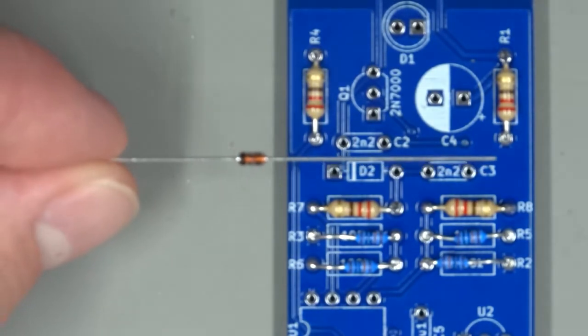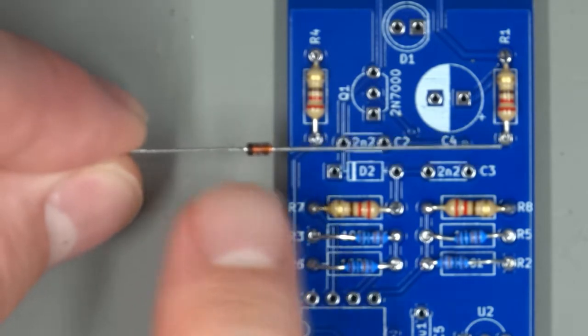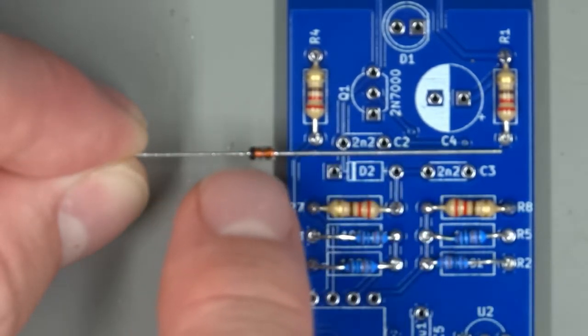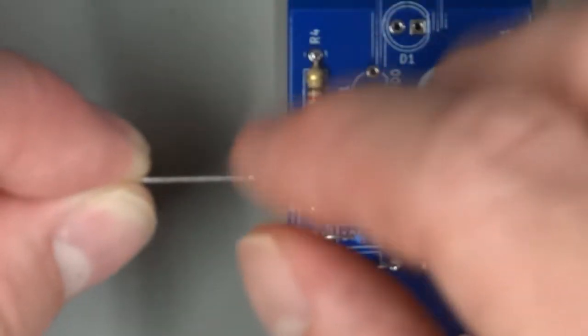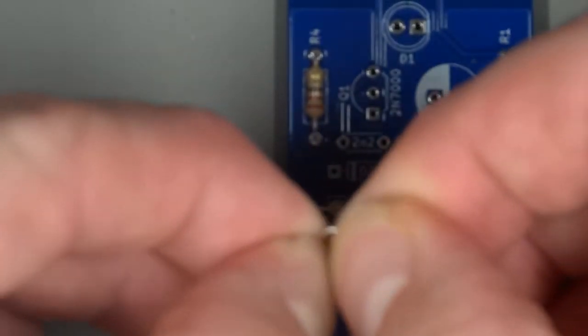So looking at the glass body diode, you'll notice there is a black stripe at one end. Looking at where this diode is installed, D2, you will see a white stripe on the footprint. We want to install the diode so that the black stripe and the stripe on the footprint are at the same end. So go ahead and bend the leads down just like you did for the resistors